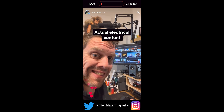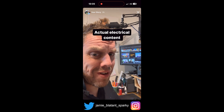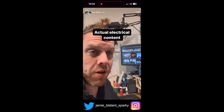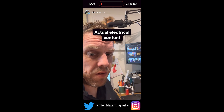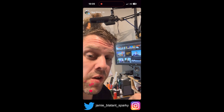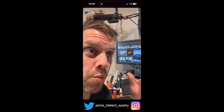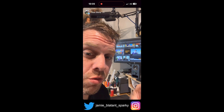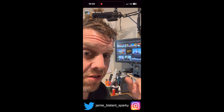Actual electrical content — and today's content is related to yesterday's content about contactors. Don't worry if you missed that, I'll put it all on YouTube as one video. But if you haven't seen yesterday's bit on contactors, this might seem quite confusing. When you're working a control panel, you're going to get various things going on that are separate layers. One of them will be the mains — the power that provides the motor, in the case of the one we're looking at, to the pump — and the protection for that pump. Also in the control panel, you'll have protection, control, and you might have instrumentation.